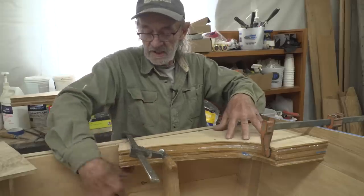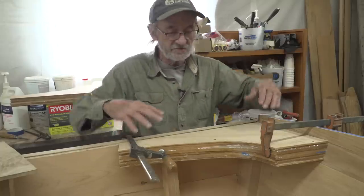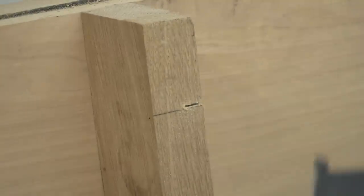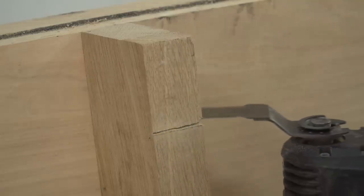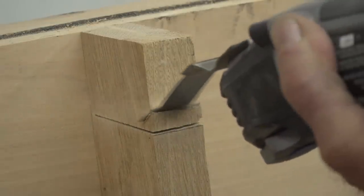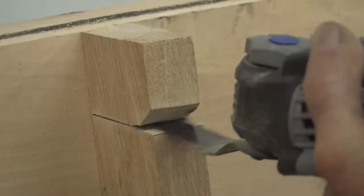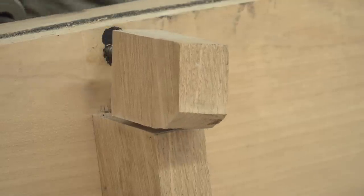I'm going to let the frame and corner frame into the bottom of the knee - it's going to be down maybe three-eighths of an inch from here and fit exactly the same, just moved down. About getting started with the vibrating tool: the machine is on slow and I'm going slow because I don't want to go in at the wrong angle. You kind of have to establish a platform for the blade - once you get that figured out it's easy to follow, but you can't get going wrong. I'm also running out of depth, so I have to cut a little triangle off there and then turn my blade upside down so that double-thickness part of the blade extends in where the triangle's cut out. You have to be very careful not to go too far and cut into what you don't want to cut.